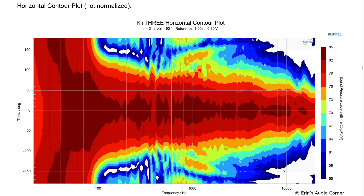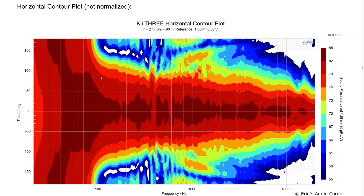Now we're looking at the horizontal contour plot — the radiation of the speaker horizontally. We're seeing a very good beam width pattern. It goes cardioid roughly around 70 Hz — you can see that transition starting to occur, and when it occurs, it occurs pretty quickly. You go from omnidirectional at about 75 Hz, and by 100 Hz you are dropped by about half. So you're mostly front-firing and side-firing by 100 Hz on this speaker.